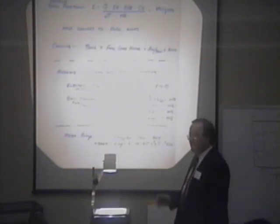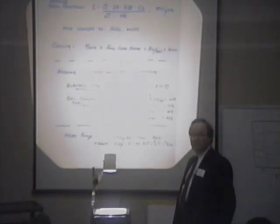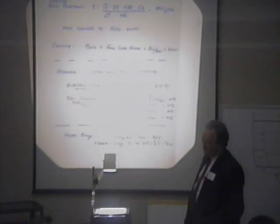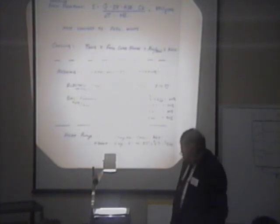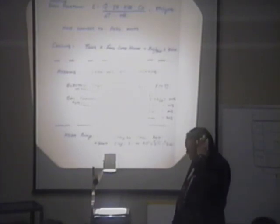Did you find any of those in the cities that you ran? We saw them in Ada. I don't remember anywhere else. I've got one on my house; in the first 2 weeks I disabled it. Because all it does is cycle your compressor a lot more. And then we did a peak load in July and August. It'll never satisfy temperature. It cycles the unit. And so the hotter the temperature is, the more it cycles, the more your condensing unit's off. And the hotter, you've got the hubs of Hades in the house. I was saving electricity. I was miserable. I was wearing my unit out. I mean, it was cycling on and off, on and off.